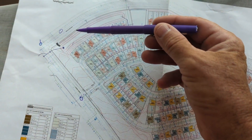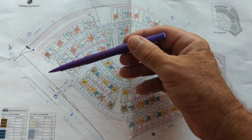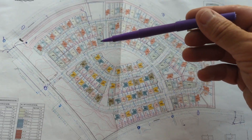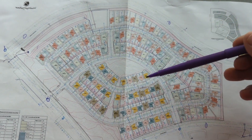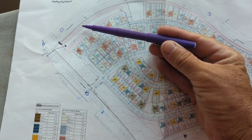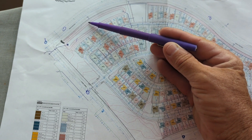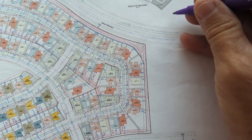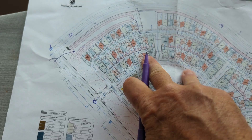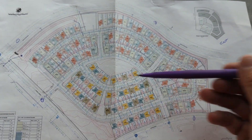Later on we'll be asked to go around the perimeter. We already have some aerial targets, but along the sidewalk around we'll probably put another 15 to 20 points, mostly around the perimeter and a couple inside for the graders. For points on the sidewalk we'll use a nail and tag, drill into the sidewalk and set that nail and tag with our control point - our tags say our company name, then CNT. Points set inside will be graded out.